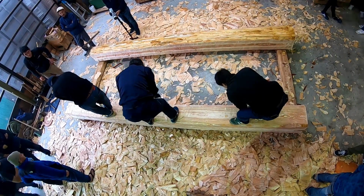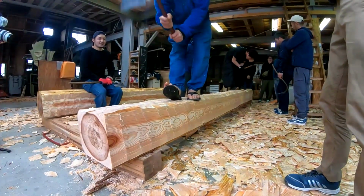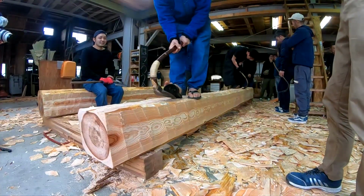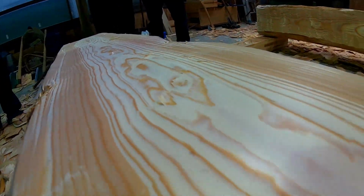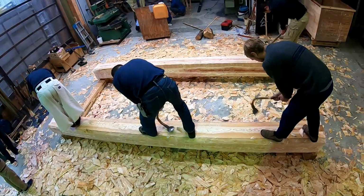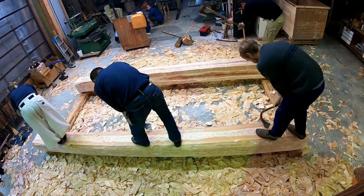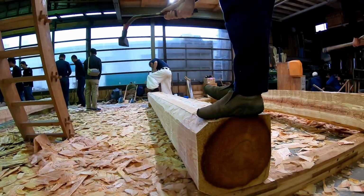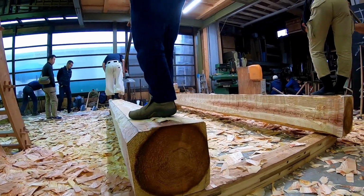The blade is fitted to a curved mulberry branch that's grown into that shape, and that provides just the right amount of spring to cause a bouncing action that cuts and pops off a chip, similar to how the masakari works. While the flat blade chona does best for cleaning a flat surface, the curved or scooped varieties can yield an elegant pattern that in many cases is left as finished surfaces for steps or seats or large natural timber frames. I can vouch that it's very pleasant underfoot.